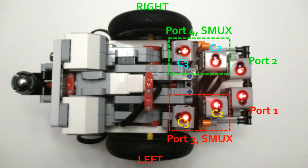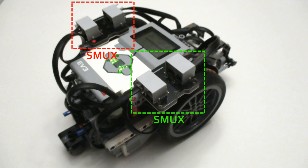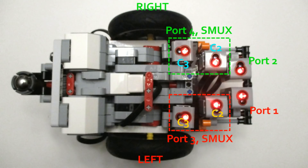Here is the hardware configuration for my six-sensor line follower. I started with my base Sirius robot, then added six sensors in front in a pyramid shape, using two MindSensors sensor multiplexers. The front left sensor is in port one, the front right is in port two. In port three we have one sensor multiplexer — channel two of port three has the middle left sensor, and channel three of port three has the extreme left or emergency sensor.